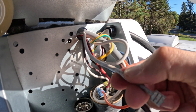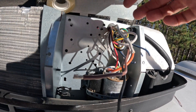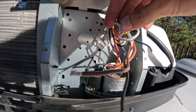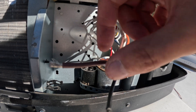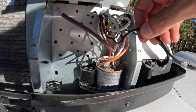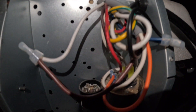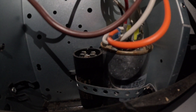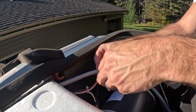We're going to cut the end off that white wire, strip it back, and splice it with the brown wire from the EasyStart. I've also cut and stripped the blue wire. The brown wire connects with the white wire; the black wire connects with the two blue wires. So to summarize: brown to white, blue, blue, and black together. The orange is on one run capacitor terminal, the white is on the other with the rest of the whites. We'll now close this up and tie-wrap the soft start wiring to the compressor wiring to keep it out of the way.